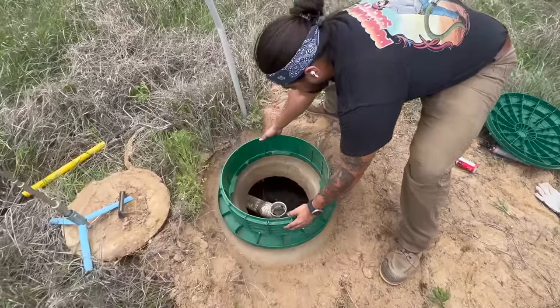I hope that shows you that it's really not that difficult to install. This is the method recommended by Wholesale Septic Supply. I know there are different methods to mount the riser to the septic tank — I've seen people concrete them down. Most precast companies now actually have the riser installed on the concrete septic tank, so most new tanks are coming out with this and you just have to add the extensions to bring it to grade. These are a great investment and you can do it yourself. How long did that take me to put both of these in? 11 minutes. That's probably the bulk of your time — digging up the lids. But putting the riser in itself is fairly easy.